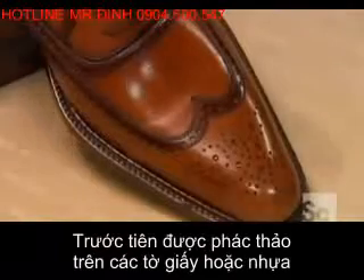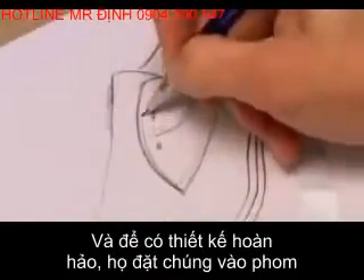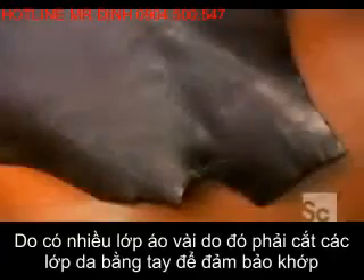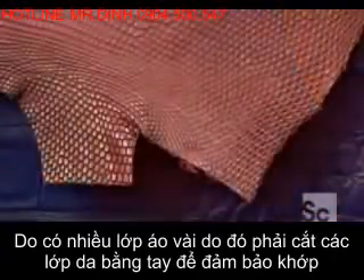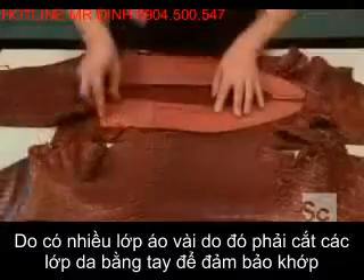The vision originates with a design sketched on a flexible plastic sheet. To help the stylist perfect the design, they put it on a rigid foot form called a last. Exotic skins have natural variations throughout, so a specialist must hand-cut the pattern pieces to ensure the right and left shoes match well.